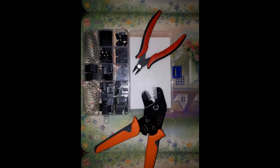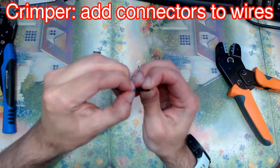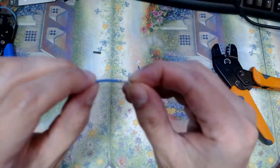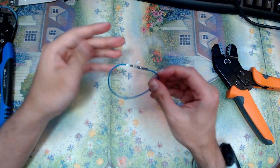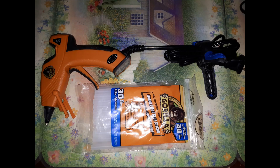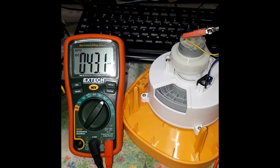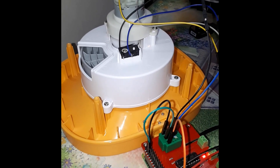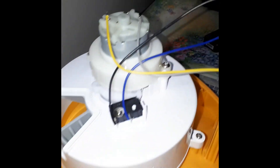The star of the show is my Dupont connector kit and crimper. With the kit, I could just cut the feeder's wires, put Dupont connectors on the ends, and plug them wherever I wanted. I use both male and female connectors — male connectors plug into breadboards and screw terminals, while female sockets are needed for the Pi's GPIO pins. It's a good idea to have an assortment of pre-made Dupont connectors in all colors so you can tell what's what. A hot glue gun and Raspberry Pi spacer kit help secure components, and a multimeter is really helpful for checking your feeder's circuitry. A camera for documenting the teardown is also very useful in case you forget how to put it back together.